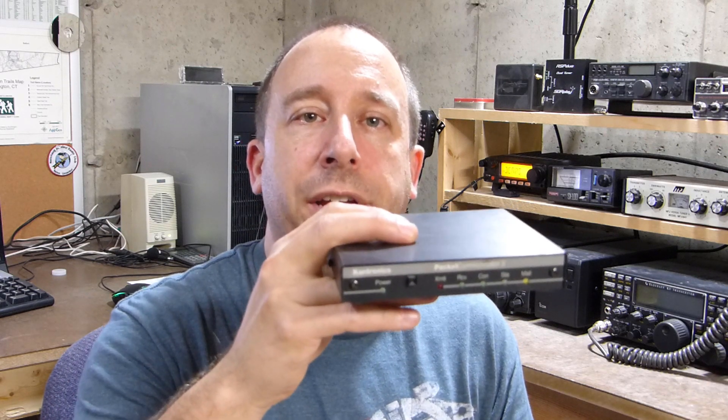Once I get my antenna analyzer back, I'll throw it on the Slim Jim and get it dialed in, which may help things a bit. My plan for the antenna is to put an old radio up here, hook up my old TNC, and get back on the air with APRS or experiment with 2 meter packet — it's probably been about 10 or 15 years since I've fooled with either one. There's some new APRS software I want to try, so it seemed like a good project heading into winter. I've also thought about using the antenna as a scanner antenna for some scanners I have here. Anyway, if you enjoyed this video please give it a thumbs up, and feel free to leave a comment or subscribe.